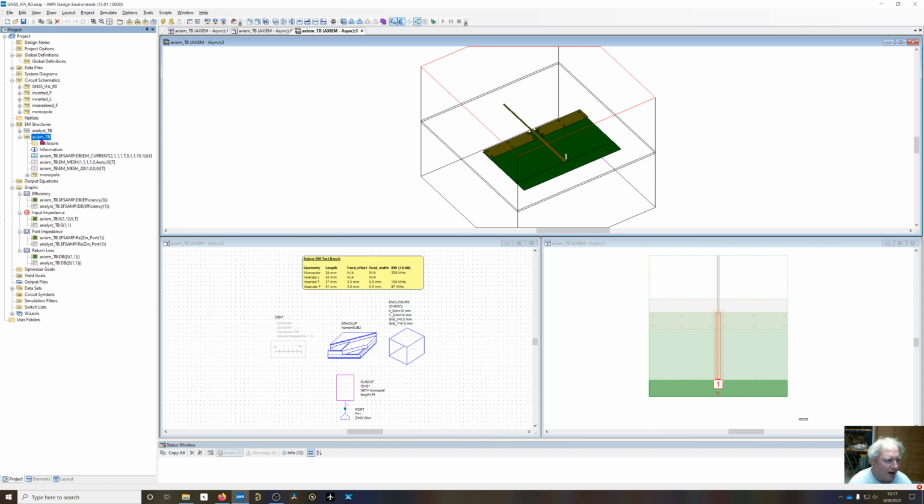For antennas, I typically like to use test benches because you're typically having to do a little bit better manipulation of the ports. With extraction, you can de-embed in reverse, but you can't de-embed forward on a transmission line. With a test bench, you can de-embed forward, and you can add on extra stuff.